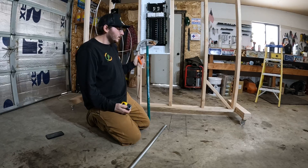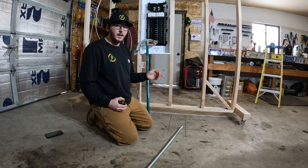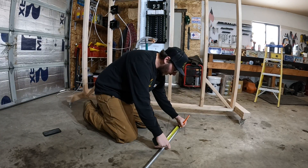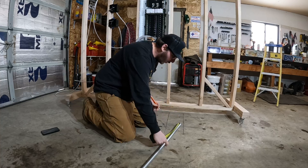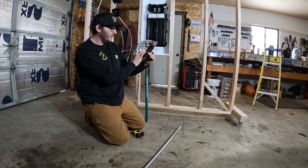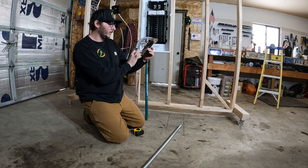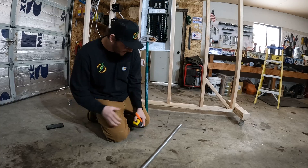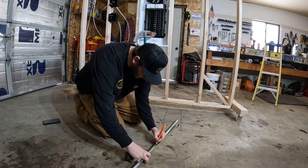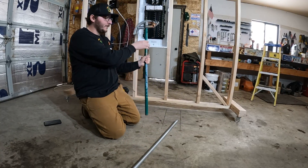To keep it easy, we're going to use 30 degree bends because the multiplier for 30 degrees is 2. We'll get our starting mark — I'm going to start at 4 inches. We take 8.6 times 2 for our 30 degree multiplier, which comes out to 17.2. We'll mark that on the pipe and then bend it as a normal offset.